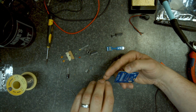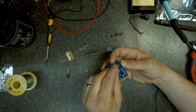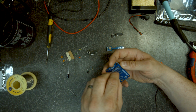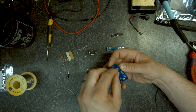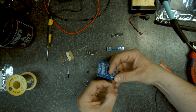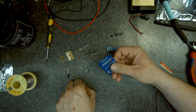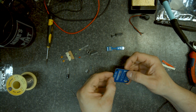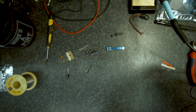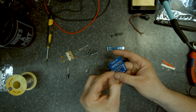We're going to put these diodes in here, with the black stripe facing forward because the stripe is there on the board. Just put them in, give them a push down. They're a bit delicate, so don't try and use cutters or pliers to bend them. Use your fingers, because you will break them. These glass diodes do break easily. Just going to check these are the right way around, little black tab at the top, as I said.